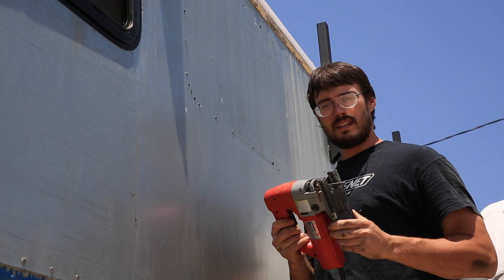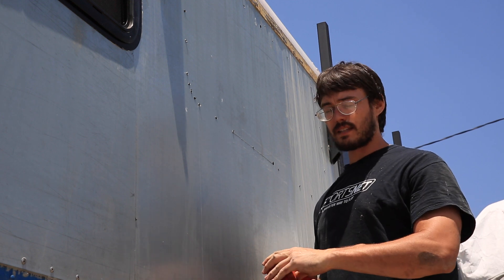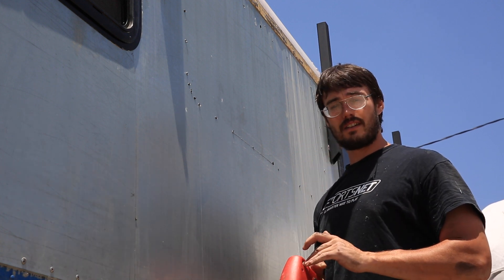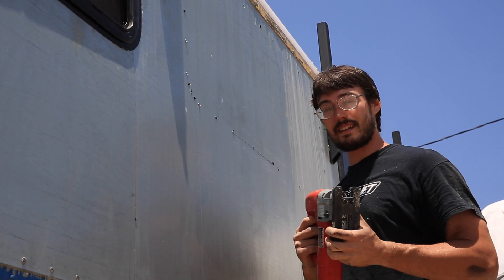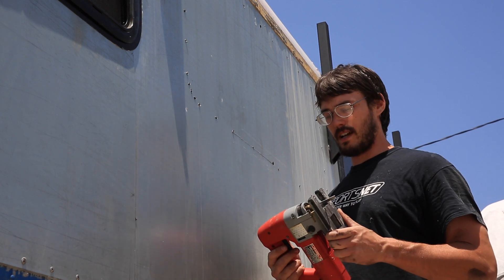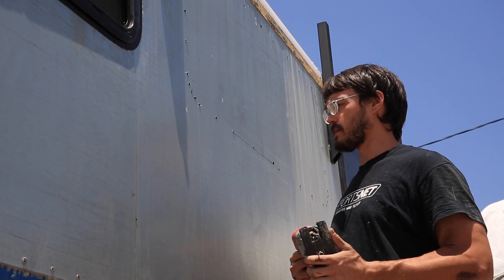I'll mention the settings I'm using really quick. I have the orbit on one on the jigsaw and the speed setting at three. So there's a small amount of orbit as the blade's going in and out. Speed is relatively slow, and that's giving me enough control over the blade itself and giving the blade time to cut through this decently thick metal. Those are the settings that have been working the best for me. You might have to tailor the settings on your own jigsaw a little bit to work best in your situation.